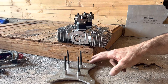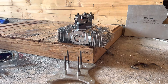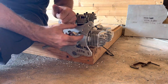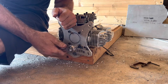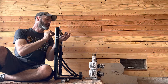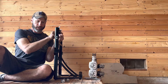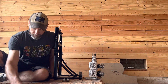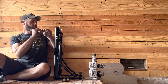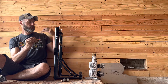The shorter spacers go here and the longer ones go here on the base plate. I'm going to go ahead and slap that on and see if everything fits. Once we do that, if it works out, we can mount this to the actual frame. I'll need to get my torque wrench and torque that down later. Right now, because I may have to take it apart again, the little metric bolts that mount the vibration dampening mounting bolts on the front just don't look long enough, so I'm going to find ones about a quarter to a half inch longer.